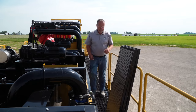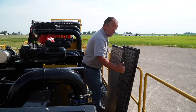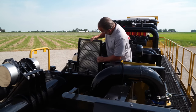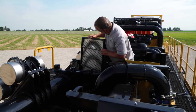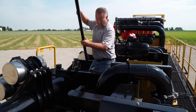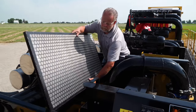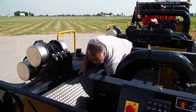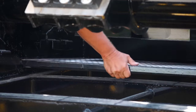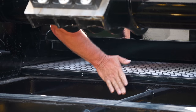Now let's look at the screen installation process. Each shaker deck is equipped with three pre-tension screens. Once the proper screen selection is decided, we can now begin to install the screen. Always check the back side of the screen to ensure the rubber gaskets are in place and there is no damage to the gasket. The first screen to be installed goes into position number one, which is toward the back of the shaker deck. To install the screen, position it inside the shaker deck between the side walls and slide the screen all the way to the back against the end wall.